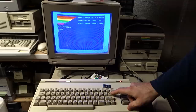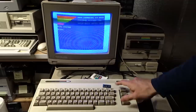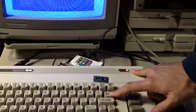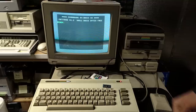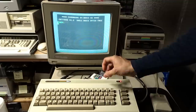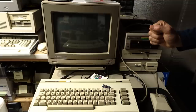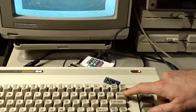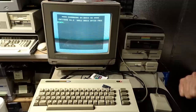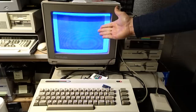I'm going to move from ROM 2 to ROM 4 — so we got 2, 3, and 4, and I let go. And now I'm at JiffyDOS, which is a modification of JiffyDOS. When you switch between ROM images, it stores the ROM you've selected into the EEPROM built into the microcontroller. So when you turn the computer off and back on, it will automatically resume back to the ROM you were using before. If I want to go back to the stock ROM, I go from 4 back to 1 flash, let go, and I'll be back at the stock ROM. All of that is possible with this little Arduino board.